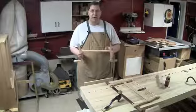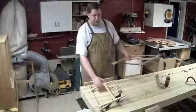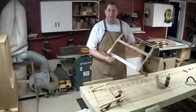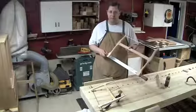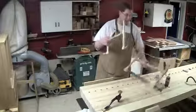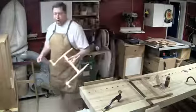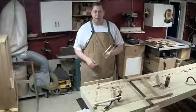This model is from Gramercy, or toolsforworkingwood.com. You hear the terms bow saw, frame saw, and turning saw used a lot. This larger saw with a big wide blade is really more of a frame saw — it's excellent for ripping and re-sawing. It is not a curve-cutting saw or a turning saw. The turning saw is very similar to the coping saw or the fret saw.